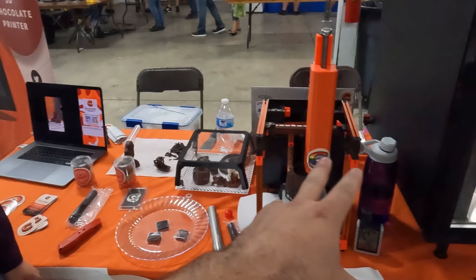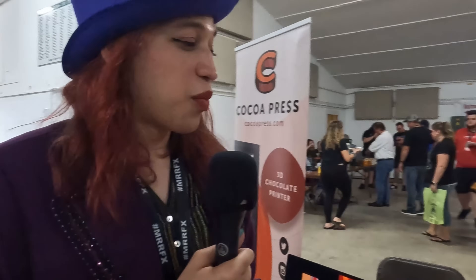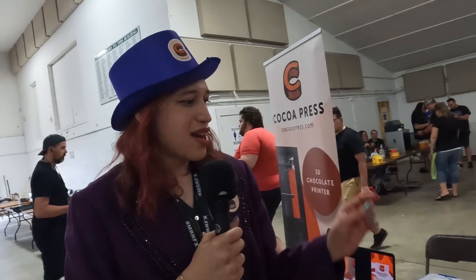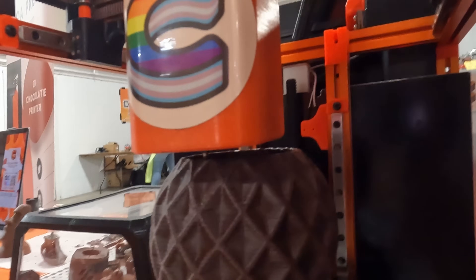So if I wanted to do this, what is different from a normal printer to one that does chocolate? First, you need to extend the Z because we have this big cartridge that goes in there, and you need a way to actually get it into the printer — so we extend the Z a couple inches. Then you need something to actually heat the chocolate and extrude it. We have a dual heating system in here that heats it to about a tenth of a degree Celsius accuracy. We're heating it to just below body temperature and pushing on it with about 40 or 50 pounds of force, and then it's solidifying right when it's extruded.